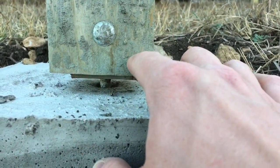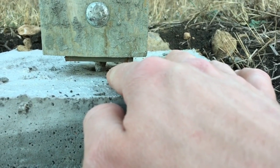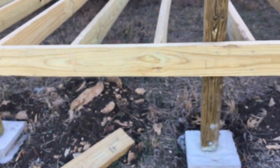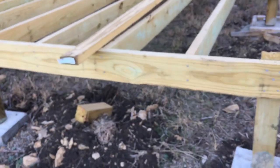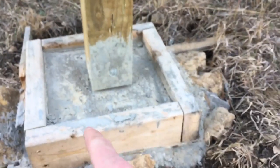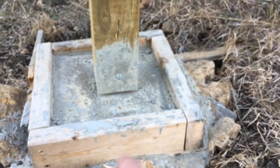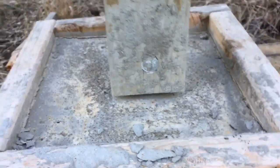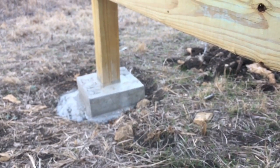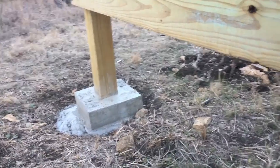Because it is treated lumber, and all lumber's gonna do that over time if it's exposed. So I tried to eliminate that as much as I could. Obviously I could have done it differently, but I'm working with minimal ground depth and very rocky, hard ground, so this is the best we could come up with — and that's fine, I'm not upset with that at all. We never got the framing off of it in time, so it's been like this since November. It comes right off eventually. You can see that big gap there. I'll probably seal that up on all the posts that are exposed. This one is actually in the concrete in the ground — that's a 40-inch piece of 4x4 there, and it is holding up very nicely.